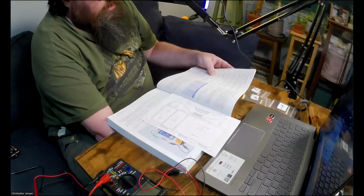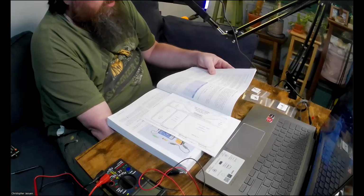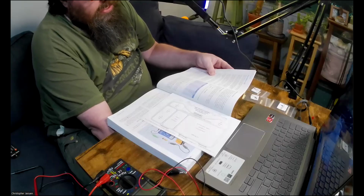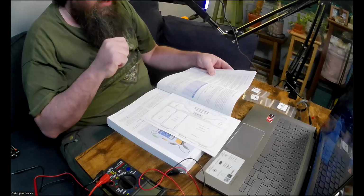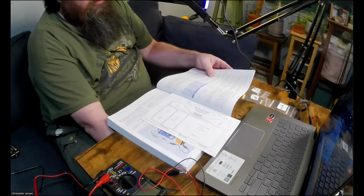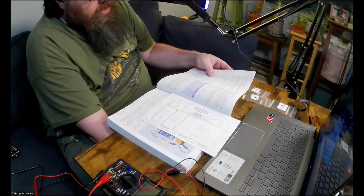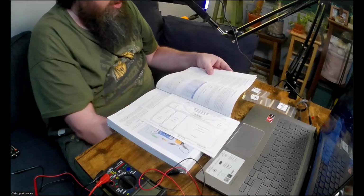Ampere basics. The ampere is an international unit abbreviated with the letter capital A. 1 milliamp, usually written lowercase m capital A, is 1/1000th of an ampere. A microamp, you use the Greek letter mu as the prefix. So that stands for microamps, and 1 microamp is 1/1000th of a milliamp. And then here he just has the conversions.